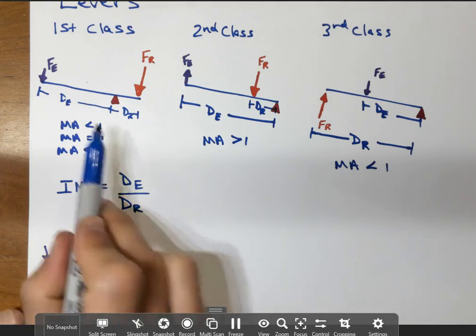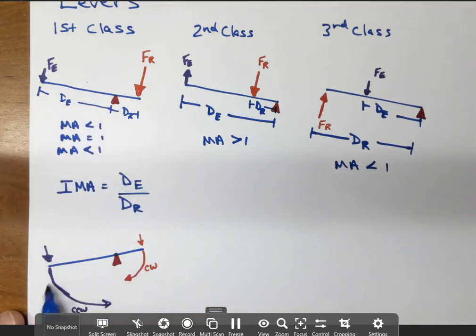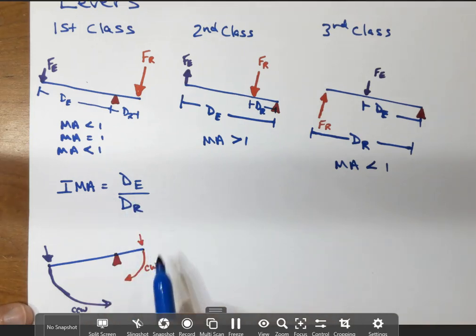And so you can see that what I've labeled is really from the fulcrum to where the effort is. And that would be, if you made a full circle, really just the radius of a circle. But we always have to make sure we compare apples to apples. The easy thing to say is, if with the force applied here we grab and rotate the lever around one revolution, well, the other end would also rotate exactly one time. And so the distances to compare, just to figure out mechanical advantage, would be the circumference, based on that radius and that radius.